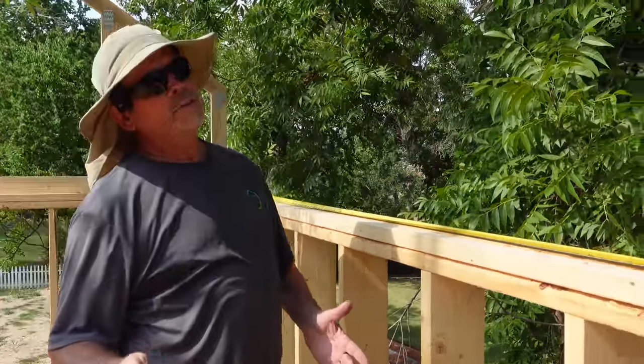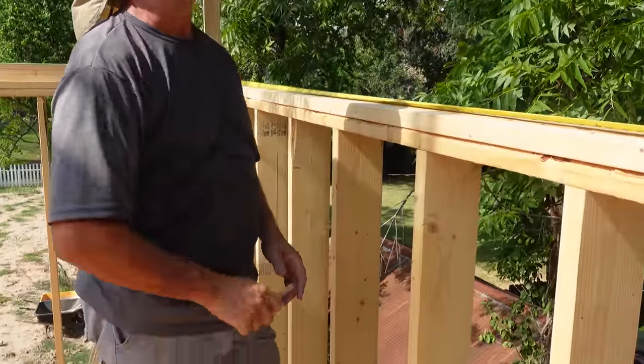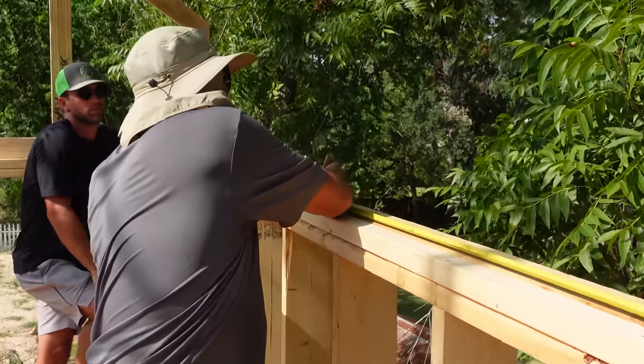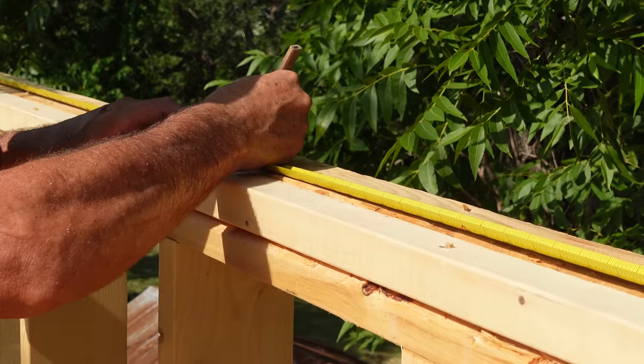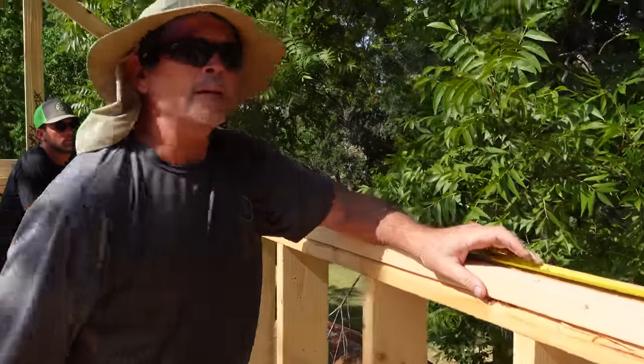And it just so happens, not really, we plan it this way, that the trusses lined up on the studs for ultimate strength. I've already got these done. You reach behind me, mark out 48, 64, 80, 96.